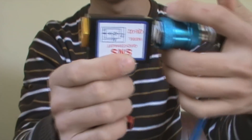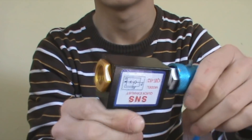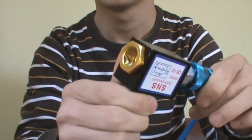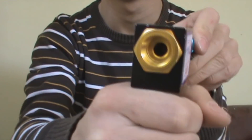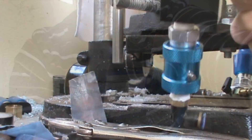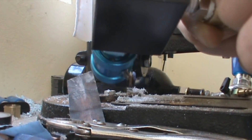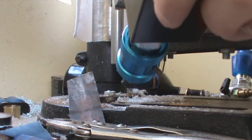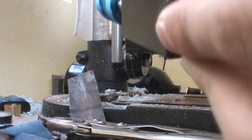You can see — I'm going to fire it. One modification you should do with your QEV is put a spring behind the piston. As you can see, I put it inside it. It should close the valve automatically after it's shut, so I won't waste too much air.